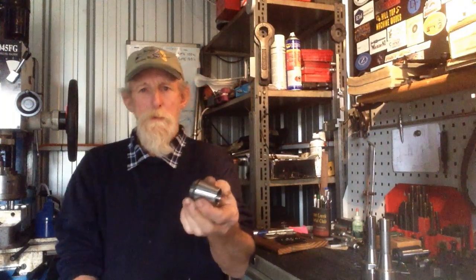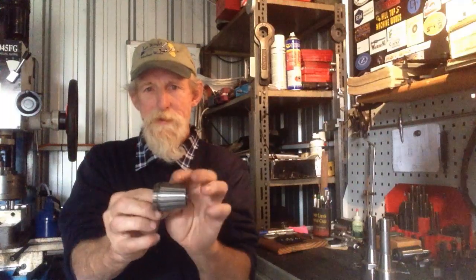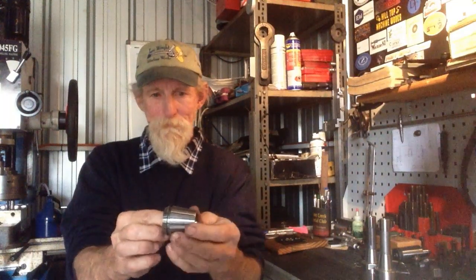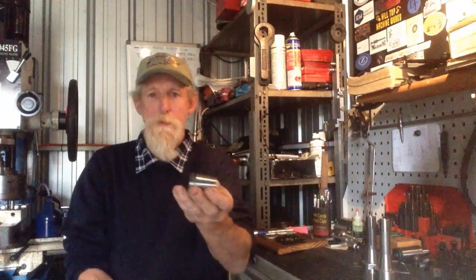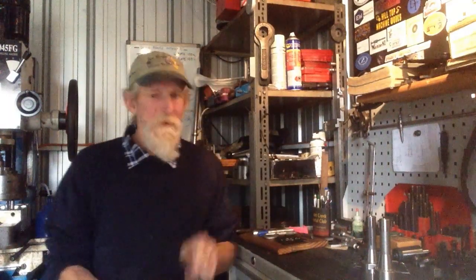But the problem is, you could put a neat fitting pin gauge in there to help hold the collet round. The thing is, if you get one of the fingers that's a slight bit prouder than the others, just the way the collet's been sprung through general use, it's going to give you a misreading when you go to blue up and check your taper. So that's why we're going to make a proper plug gauge to the proper taper. Over to the lathe, and we'll knock these threads out first, and then we'll move on to setting up for the taper.